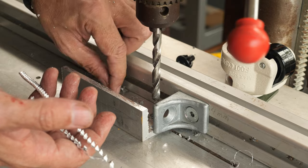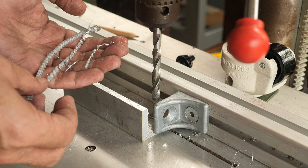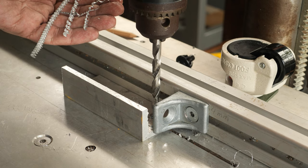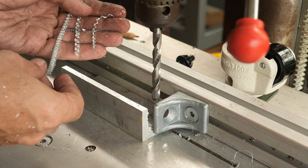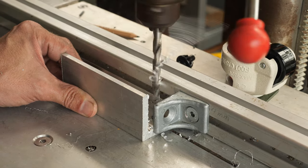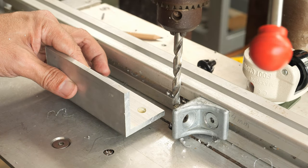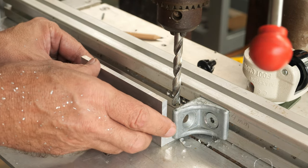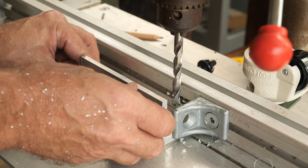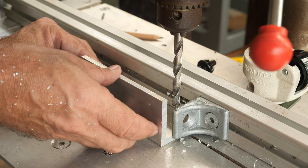This kind of curly chips is what we really want when cutting metal — not just aluminum — because this keeps your drill bit sharp. If you start getting powdery spatter, you have a dull drill bit and you're applying the wrong amount of pressure. Once I started the hole, I continued with steady, slow pressure. For soft metals we use low rotation speed, low RPMs. By using the drill press we have the strength advantage, and with the fence and stop block we have repeatable accuracy. If you don't have a drill press, you can still do it with a hand drill using a jig to ensure consistent spacing.